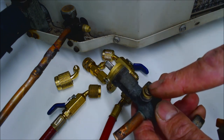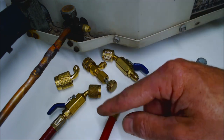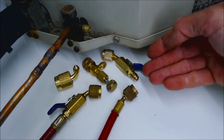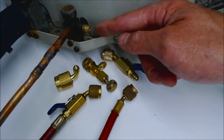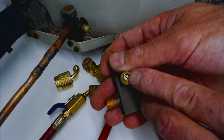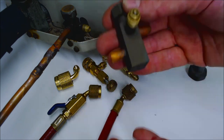The problem comes when you're disconnecting — whether from a valve with or without a valve core — you don't want all the refrigerant in the hose connected to your manifold gauge set to come right out the end. Some low loss fittings also make sure the valve core is reseated before it even disconnects, making it more controllable.